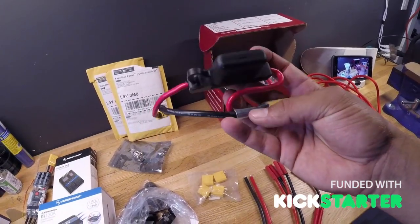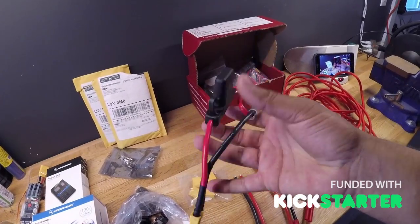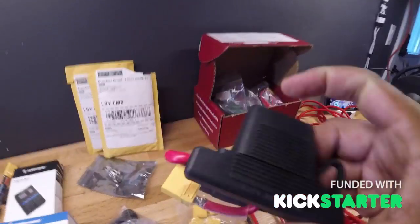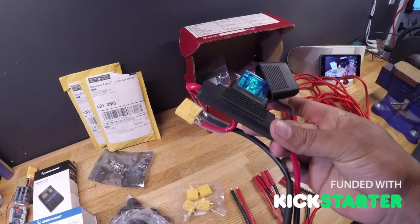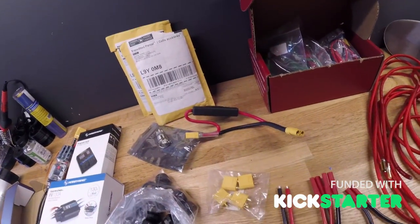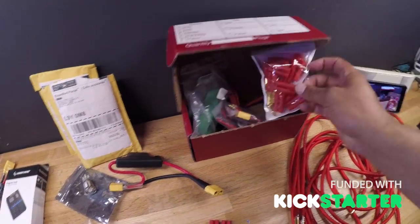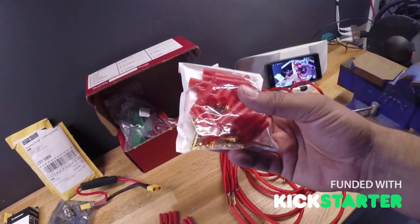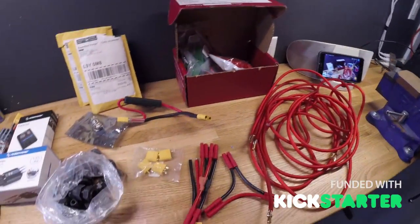I'm not sure 60 amps is going to be enough — I was playing with the motor in the water and drawing about 30 to 38 amps on full throttle trying to drag myself on this tiny surfboard. Once you get up on a foil it'll drop off dramatically, so 60 amps could work. The fuse inside is 60 amp — if something gets drowned and shorts, it'll cut itself out and save the batteries. Some of the connectors I got turned out to be garbage, only rated for 40 amps, when we could be drawing potentially 130 amps.